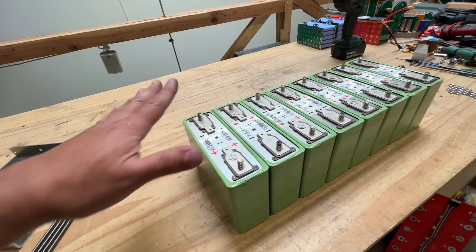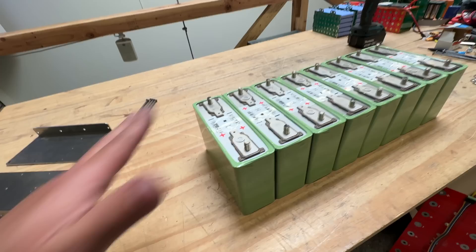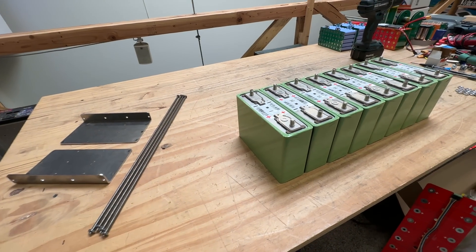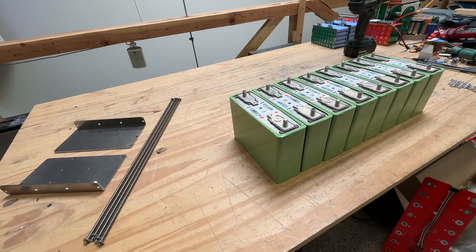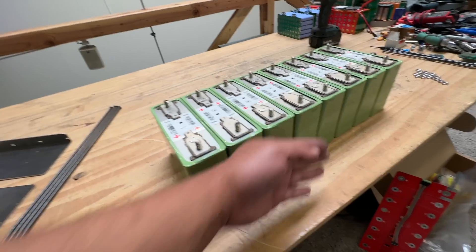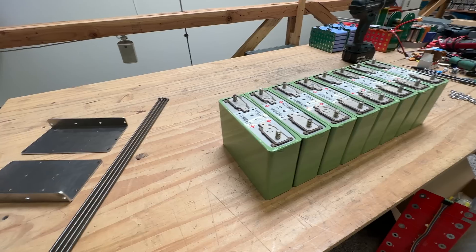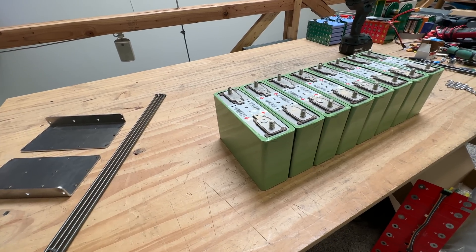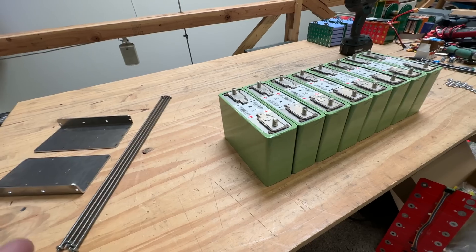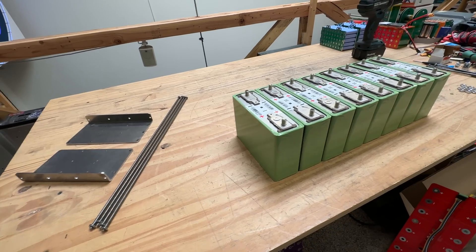These are the 12-volt battery that runs the 12-volt systems in those cars. In videos I've seen, they show them compressed in a small box that makes them look just like a typical 12-volt battery, but much lighter and much more capable because they have lithium iron phosphate cells inside.